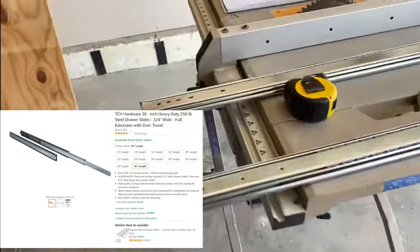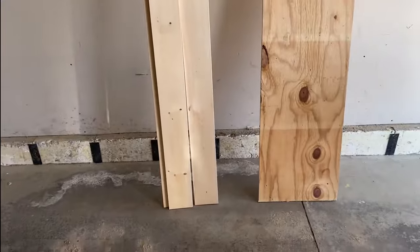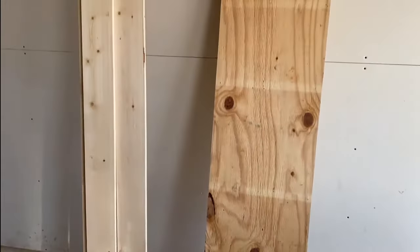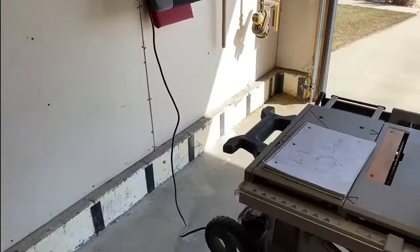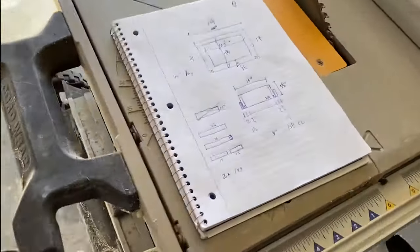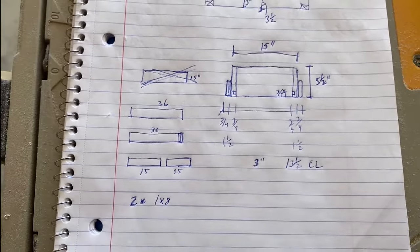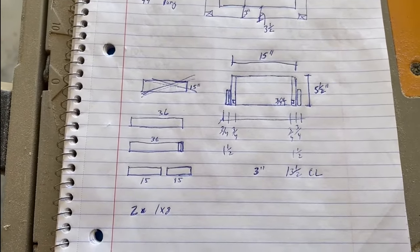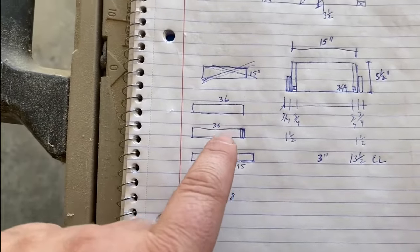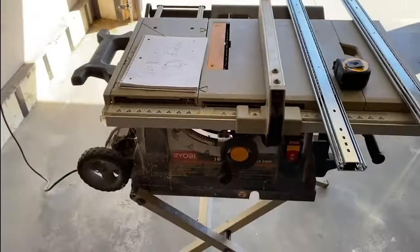The price I quoted you will probably be wrong, but whatever. We got some one-by-six pine to build the sides out of, and I had some scrap half-inch plywood to make the bottoms out of. The three feet — we wanted it to be pretty stout. I'm rocking the crappy Ryobi here. Here's my sketching when I had measured all the openings: the drawers are going to be five and a half inches high, slides are three-quarter inch thick, shimmed out a little to get past the drawer front opening. Three-foot long sides, 15-inch wide interiors. Let's cut some stuff up.